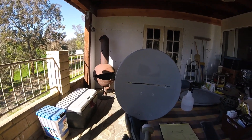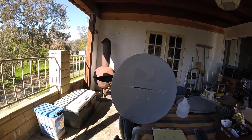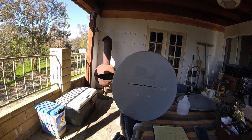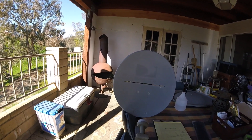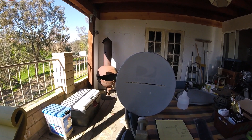The actual slot is the antenna. It's an inverse dipole. It's very broad-banded. A horizontal slot creates vertical polarization. There are nulls off the side, but other than that it's a very efficient disguise antenna.